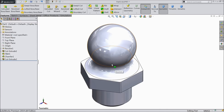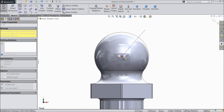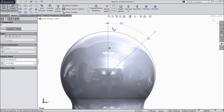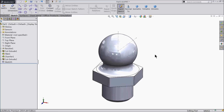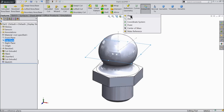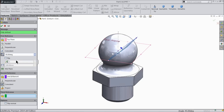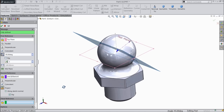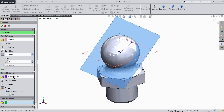Here we want to create a 45 degree grease nipple, so we have to create a separate plane at 45 degree. Let's do the front plane sketch and draw one sketch for a 45 degree plane. Select construction line up to origin point, smart dimension, and define the angle. Let's keep 45 degree and simply exit. Now we will create a plane with the help of this line. Choose here top plane and select plane. Select here this outer line. For top plane keep 45 degree. And for line here select the relation project along with normal flip. You can see the plane going to create at 45 degree with top plane and pierce along normal.